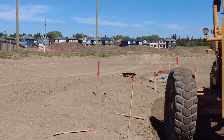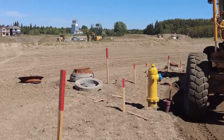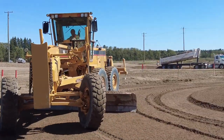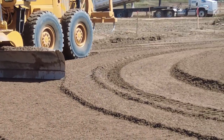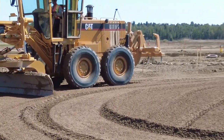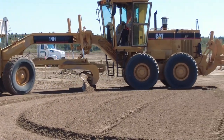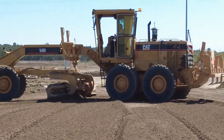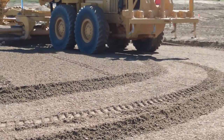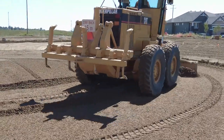As you do this, you have to be careful of this valve and this hydrant — you've got to keep that in mind. Sometimes there's a CC back there too, but this one doesn't have a CC. Your back blade pretty much takes the tracks out of it. Now I'll keep my articulation going and I'll come around and I'll more or less screw myself to the center in a way. I'm out a little ways from the perimeter now, and I'm probably fully articulated now.